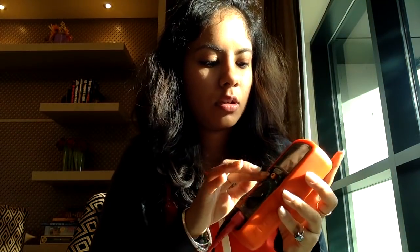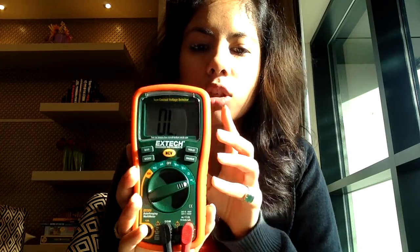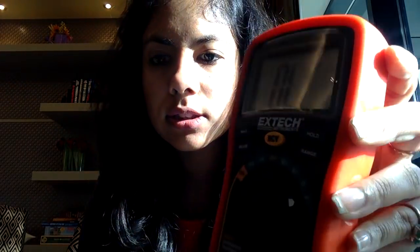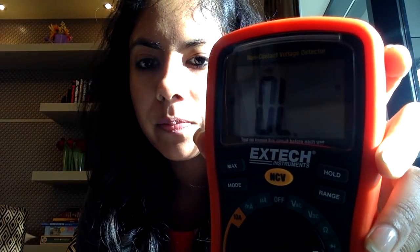The other thing you can do with your multimeter is determine whether a connection has actually been made, or whether two holes on your breadboard are actually connected to each other or not. To do that, you will turn your dial to the diode mode and press the mode button. What you should see on your multimeter screen is a sound signal. You will take your two probes, check them by touching them together — when you hear that noise, that noise signifies that a circuit connection has actually been made.